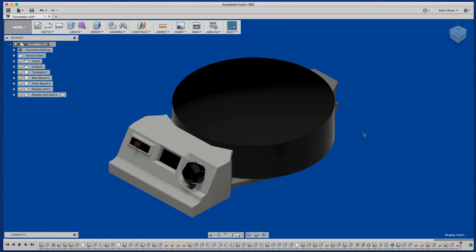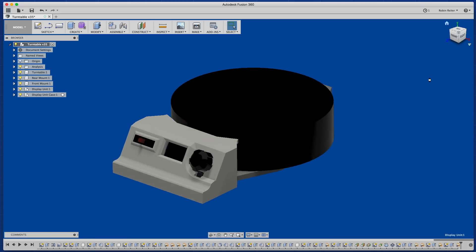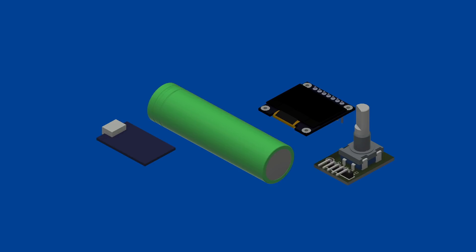With that installed, let's proceed with the actual console. I chose a pretty unconventional method of putting my electronics into this box. First I thought about what components I actually need: there is a display, a rotary encoder and a battery. Then we obviously need some charging and protection circuitry to make this device safe and user-friendly. To control the motor I'll put in one of those dual H-bridge modules — we only need one H-bridge, but that's what I have laying around. And because this motor does not run at the battery voltage, I'll put in a boost converter to up it to 15 volts. The brain of this whole operation will be an Arduino Pro Mini running at 16 MHz.